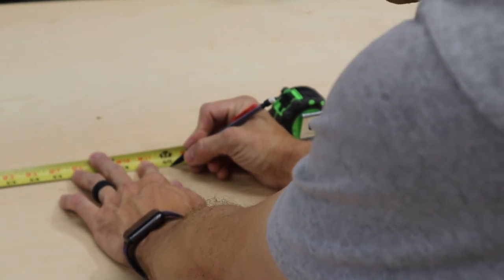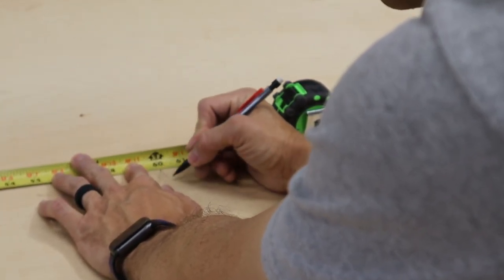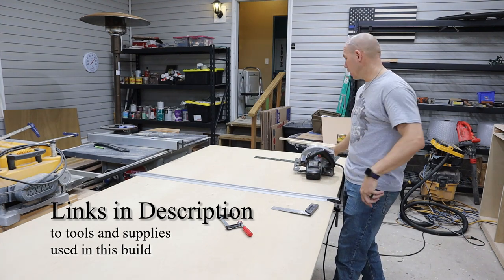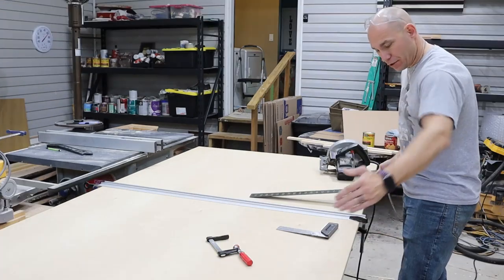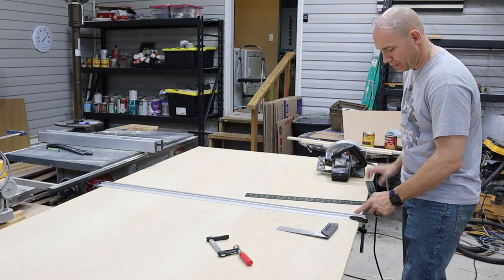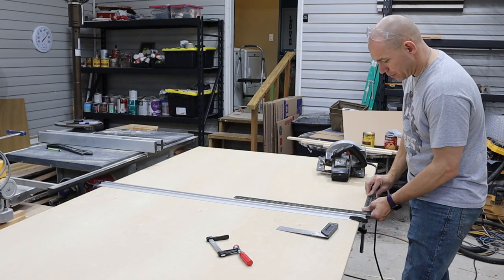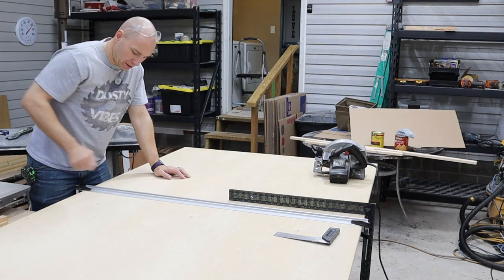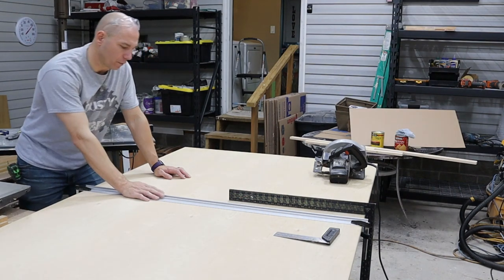What I'm going to do is rip this in half — you've got 48 inches wide and we're going to have two equal-size shelves, so it'll be about 23 and 7/8 inches wide by the time you account for the saw blade. This straight edge has a raised part on one side — I'll drop a link to all the tools and supplies in the description below. I measured five foot and made a line, and from the edge of this straight edge to the inside edge of my saw blade is four and a quarter inches, so I've measured that over to make sure I get it perfect. I use a framing square to square this up with the edge — it's a perfect edge guide for circular saws when cutting sheet goods.